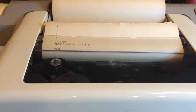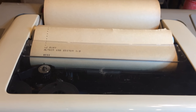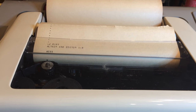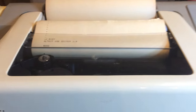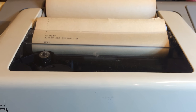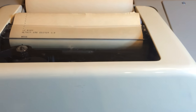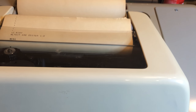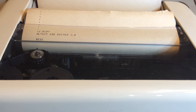What it was doing there when it was chugging away was putting a bunch of null characters in, because if the paper tape punch was running, that would put a leader and a footer on the tape, which makes it a lot easier to get it into the loader.